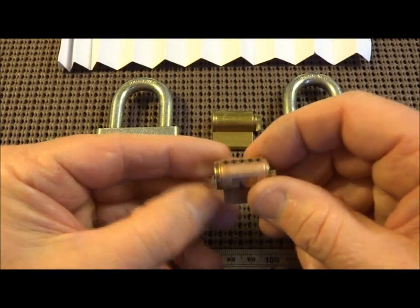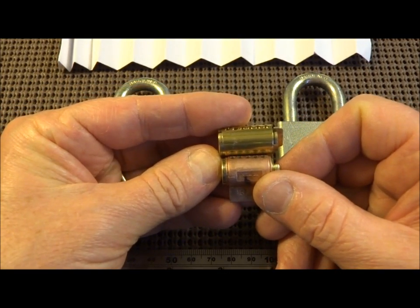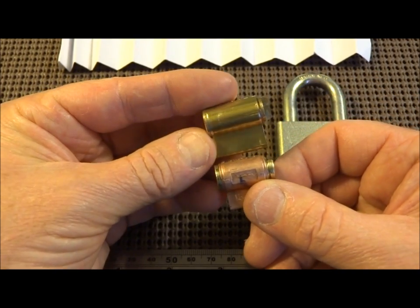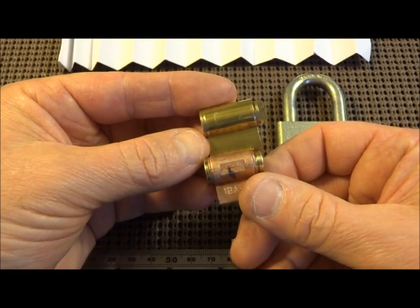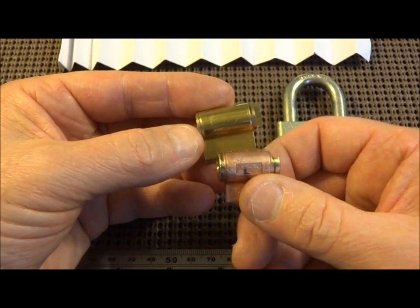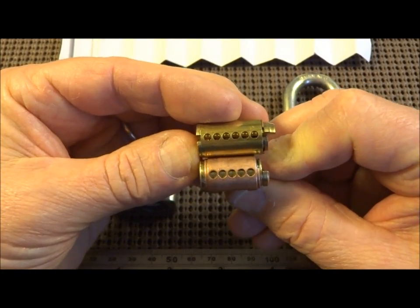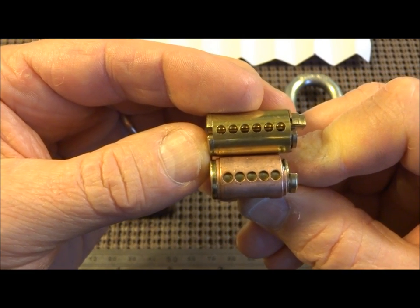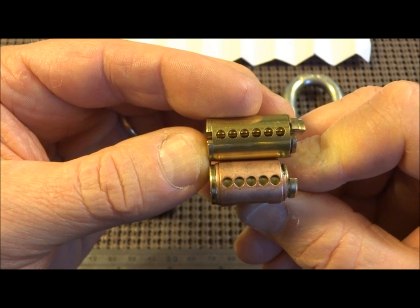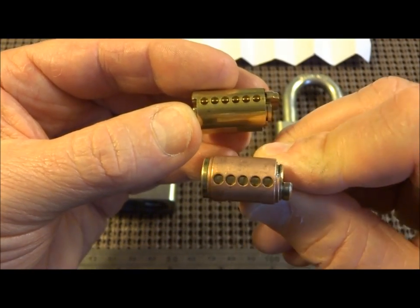This is clearly an inferior core, because normally the cores in all locks older than from November 2011 look like this — the one we're all used to. There are some rather significant differences. First of all, the coloration: the new one is a cheaper cast, copper-looking or at least copper-coated. It's shorter, because the old cores had six pins. American only usually pinned up five of them, but at least it gave us the option to pin up that sixth one to increase security. This new, cheaper core does not.